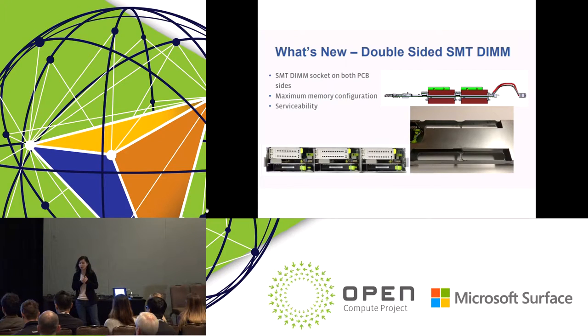We changed the motherboard components to be all PIP process compatible, and we've done multiple PCBA builds. It's been proven reliable, and we can achieve a yield rate as good as the single-sided. The lower left and lower right pictures show how the double-sided board sits in the chassis. It's in the middle of the chassis, and we have components on both sides.